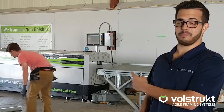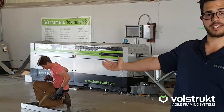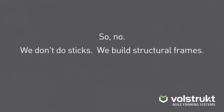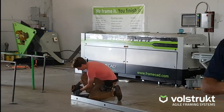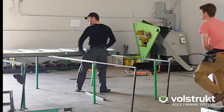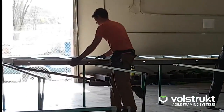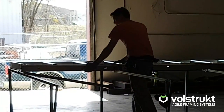So once the steel has been cold rolled and pumped through our machine, the guys in the shop will take the studs and bring them to the assembly table behind me. At that point they match up all the sticks, get all of the screw holes together, and then they drop our highly specialized engineered screws that are made to not back out. Then they flip the panel over and do the same thing.